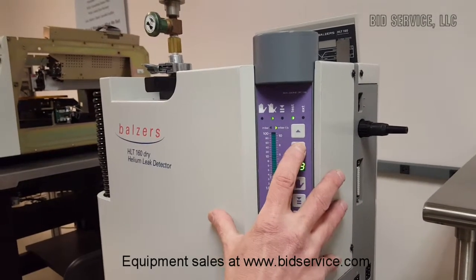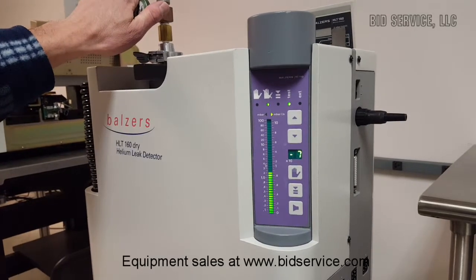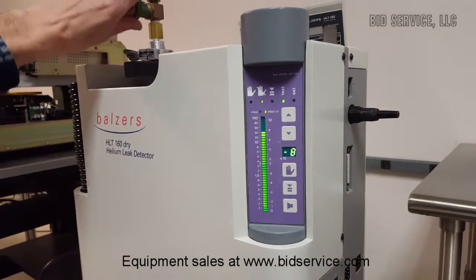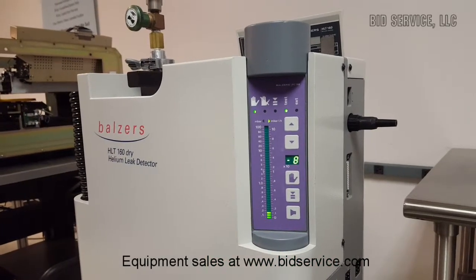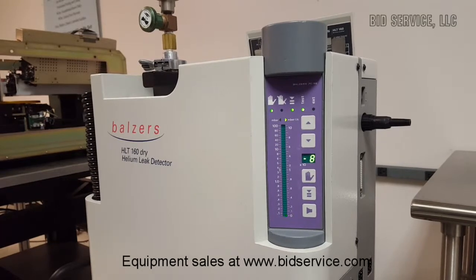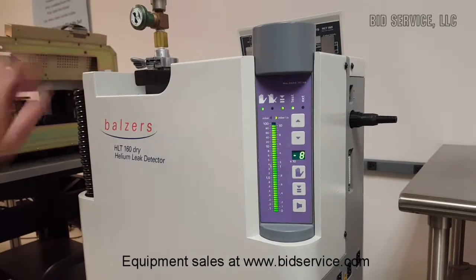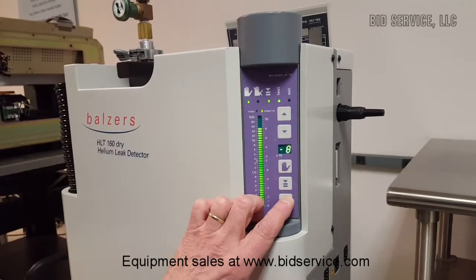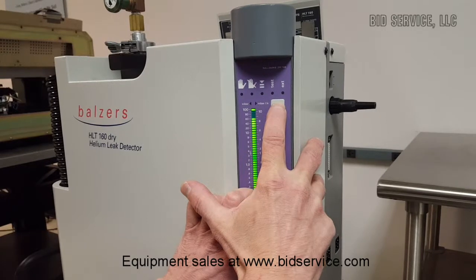You can adjust the range down, for instance, as long as you're not in auto-range. It won't let me go into 10 because it's right at 10 now. In auto mode it'll find the correct range — I can bring that down, there's our 8 range. That's auto mode. What we can do is go to manual. We'll do a zero on the background by hitting the down arrow. At this point our speaker volume will be enabled. Hold this for two seconds and you can adjust the volume level. I'll bring it up to full.